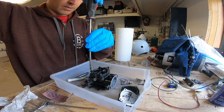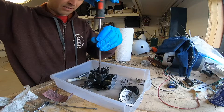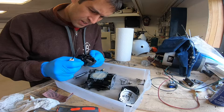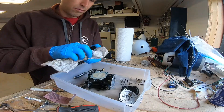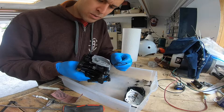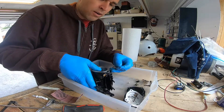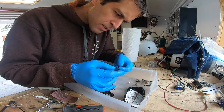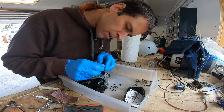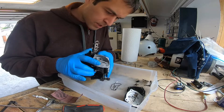I'm going to pull the pump side apart and take a look in it. I expect it to be just as good as the other side but I'll take it apart anyway. I think what I'll probably do is order a rebuild kit for it just because it's old and some of the o-rings are starting to dry out a little bit. I don't see any obvious issues with this — it should be working fine — but I'll order a rebuild kit anyway because all it would take is for an o-ring to be seeping a little bit. The needle valve or poppet valve is still pliable, but I don't actually have a poppet valve tester, so it might be bypassing a little bit, which is all it would take to cause it to run rich.